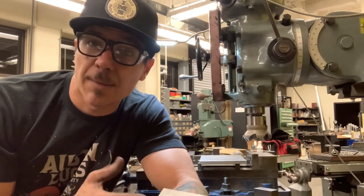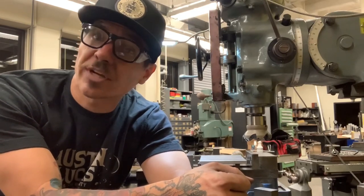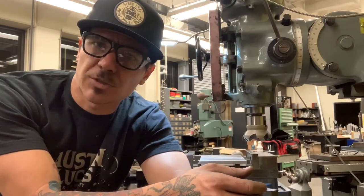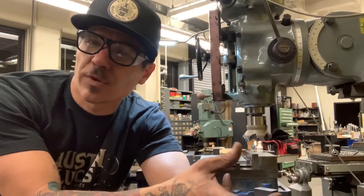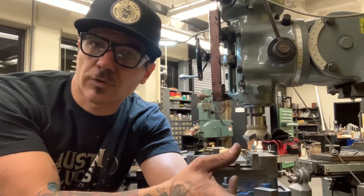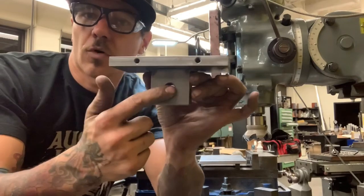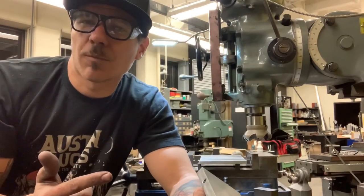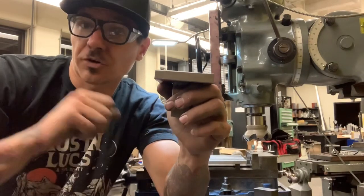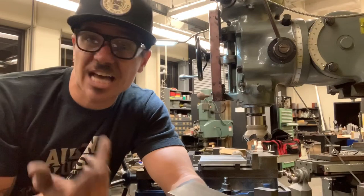I made all those dies and now I have to hold them and put them in and out of my machine. Andy over at Coal Ironworks hooked me up with the quick change die upgrade kit — it works really well. You tap the pre-existing hole that's already there with a 5/8-11, and then you can use a set screw or these handles. The problem is I had the old system with a hole and a pin, and while the 5/8 set screw will still go in, you have to turn it a whole bunch to get it in and out — so it doesn't really make it quick change.